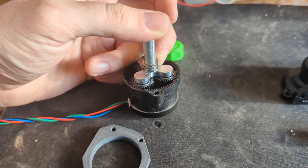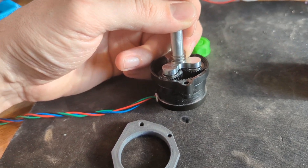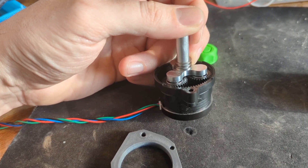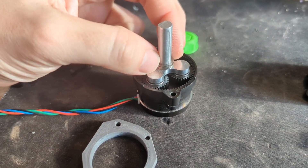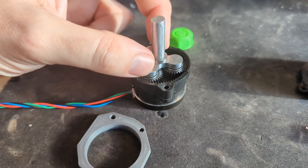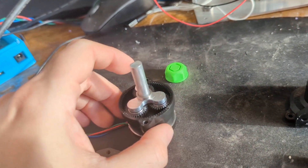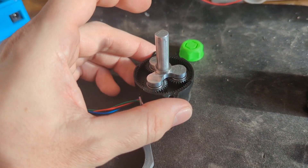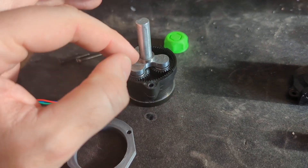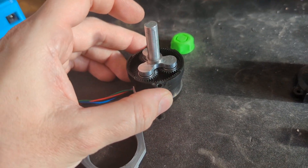I actually had two Galileo 2 kits, so I had extra shims. I've currently got four shims here, which gives me two millimetres of spacing. I don't really know 100% if that's what's required, because it's obviously hard to see what's going on inside once it's assembled. But this seems to be good. I'd recommend buying a pack of these shims and doing some experimentation.